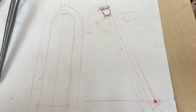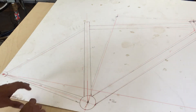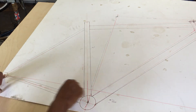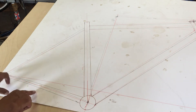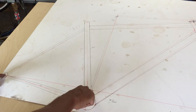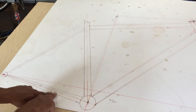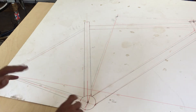From axle line to the top, I can just transfer that over to my full-size drawing and it makes it a lot easier to mock everything up. In the full drawing, I started with an infinite horizontal axle line. With 422mm for the rear end length, you can pivot it down depending on how much drop you want. I went with six centimeters of drop, which establishes the center of my bottom bracket.